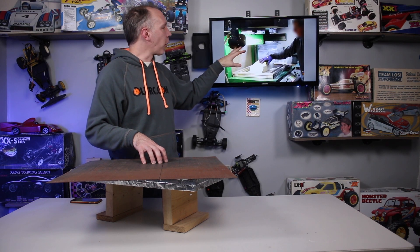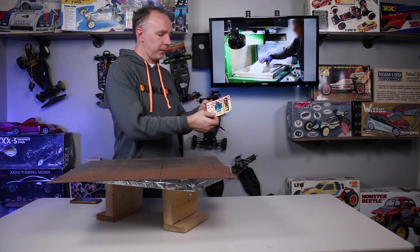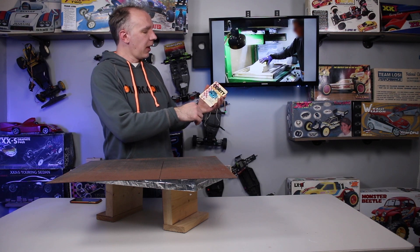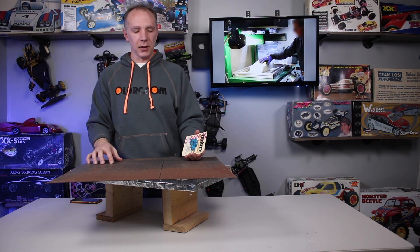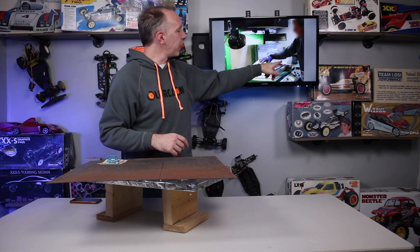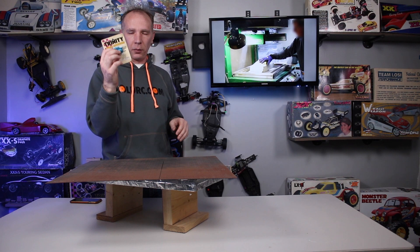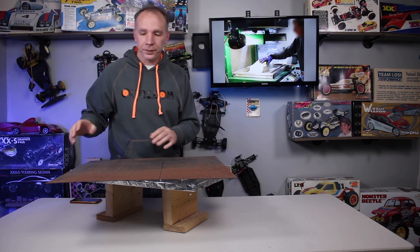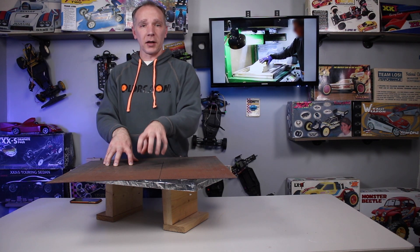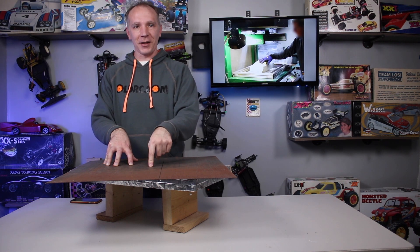This is a more modern photo of a skin packaging machine. Skin packaging machines are generally used for packaging retail items. In a place doing skin packaging, you'd have a big cardboard sheet with artwork repeated on it, put down the individual parts, bring a roll of film into the frame, heat it up, drop it down right onto the parts, take it to a die-cutting machine to cut everything out into individual parts, and ship them off to hang on a retail hook. That's what a skin packaging machine is for — it doesn't have a design consideration for securing stuff down to the platform, which is what you need for real vacuum forming.